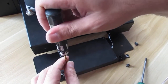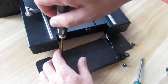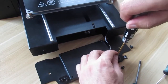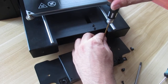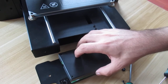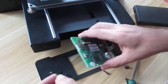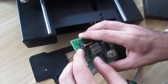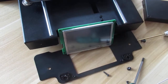And the other hex screwdriver. Open these 4 screws here, these 4 bolts here. And take the back panel out, and here's a micro SD card, right? And put it in this SD card slot, and just click it once, and then turn on the printer.